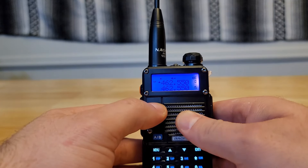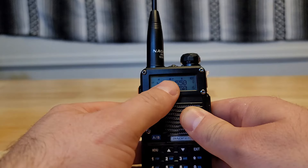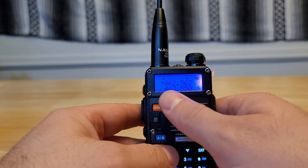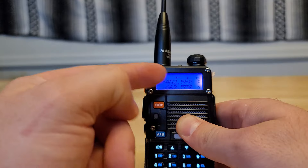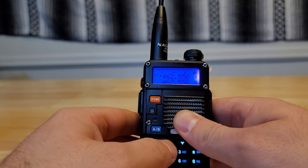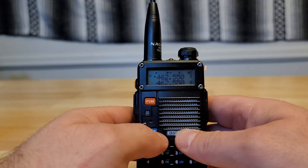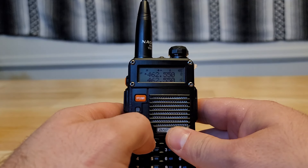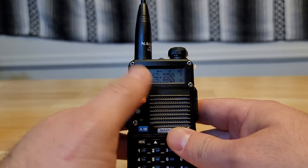Now I'm set. Switching over to channel mode — I'm on channel 1 and you can see a CT symbol here, meaning I have PL tones programmed, and a plus/minus symbol meaning I have an offset properly programmed. Channel 0 is just a normal simplex channel without that information, so I know I did this right. To verify, when I click transmit it should show 467 — and there's my squelch tone, so I keyed into that repeater. That was the down-and-dirty simple how-to for programming a simplex channel and a repeater channel. Got questions? Reach out, or check out Not a Rubicon's YouTube videos and others who are a lot more knowledgeable. Thanks for sticking around — see you guys later.